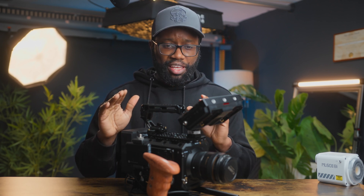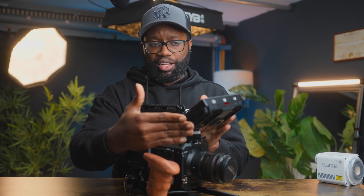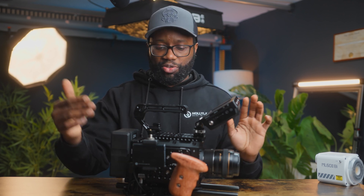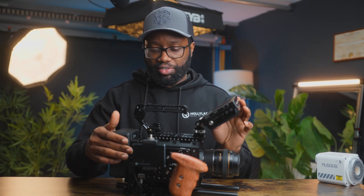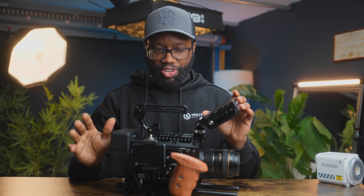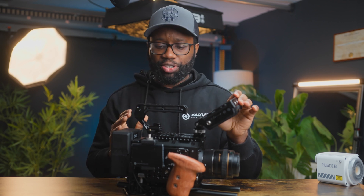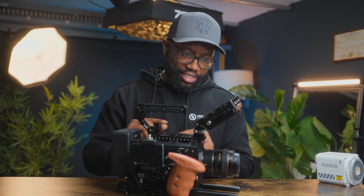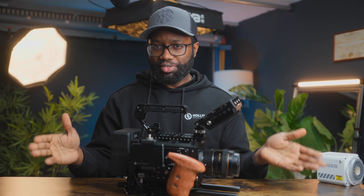This is how you should connect an SDI cable to your camera and monitor — whatever camera or device you're using. If you have an SDI accessory, like this 5-inch Blackmagic Video Assist 12G HDR monitor, here is the proper procedure: first, power on your SDI accessory — plug in the power cable and make sure it's on. Then power on your camera, so both the SDI accessory and camera are grounded. The last step is to connect the SDI cable. When powering off, the first thing to do is disconnect the SDI cable first, then power off.